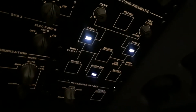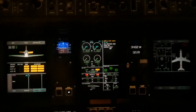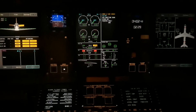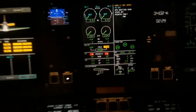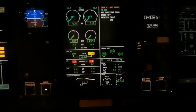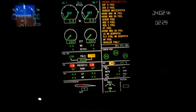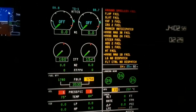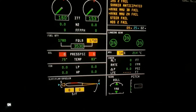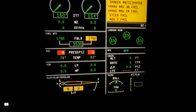You see, the lights are on — that means it is actually turned off. This aircraft has a lights-off concept when the systems are running. All these little messages, obviously, because the airplane's off. Waiting until the APU actually says off, because that's its little cool-down period. The amber came back because I took off the crossfeed, which is fine — no big deal. Now it's off.